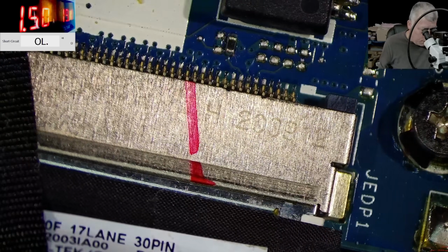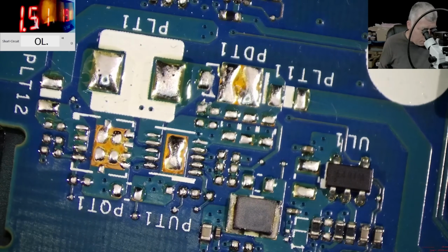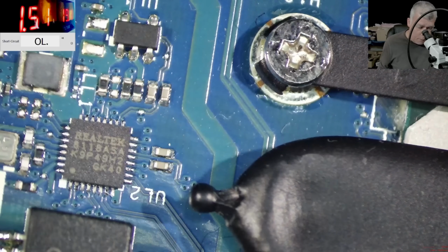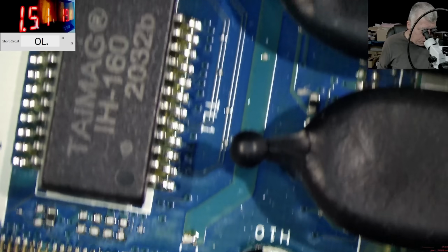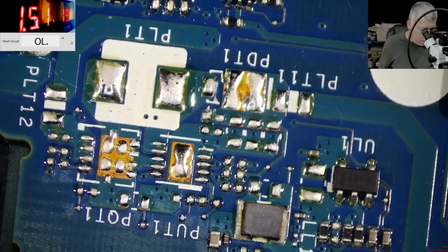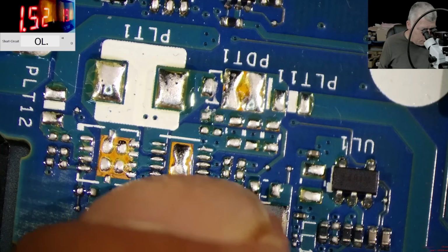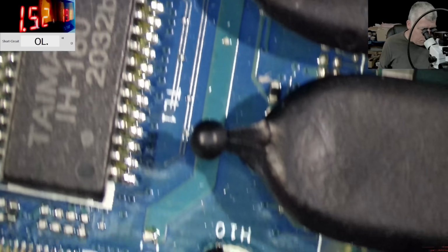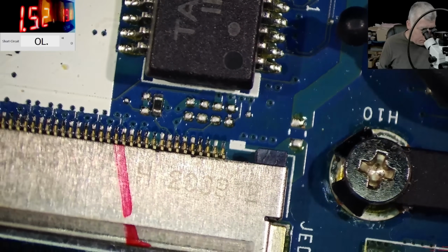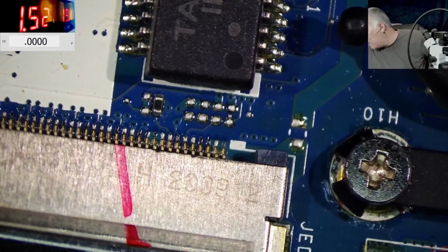Okay, so the screen backlight is there. Oh lol, what happened here? Wait, one second. I'm assuming this track, the big one, is the screen backlight, but nothing is fitted on that track. Okay, this is weird. I've never seen something like that. Or this is a switching power supply. But for what? Because this big track can only be the backlight. Okay, let's check the voltage there. Yeah, weird design. Never seen something like that.